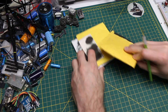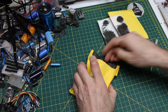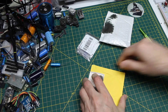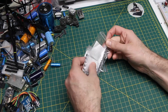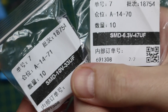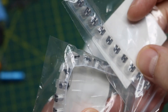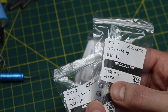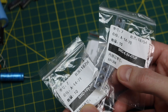Starting off, we have a couple of things from the same category: surface mount miscellaneous parts. I'm expecting capacitors, diodes, and an op amp, and it looks like that's what I've gotten. 47 micro and 33 micro, 10 volts and 6.3 volts — surface mount electrolytics I can use in basically 5 volt circuits. I'm making a PCB with addressable LEDs on it, so I need some bulk capacitance for the 5 volt power rail.